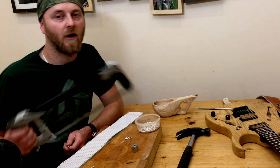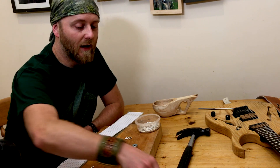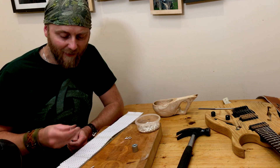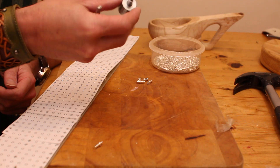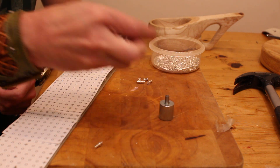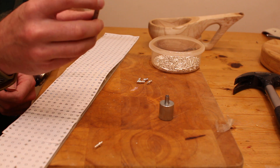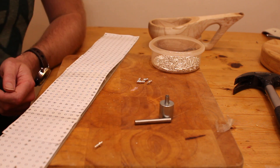First thing I needed was a metal saw because I had to chop the board down — it didn't quite fit in the metal chassis. Then you can get these turret staking tools: a little block, a tube, and then a pin with a beveled edge so that you can put the turrets in.